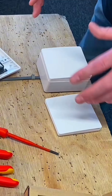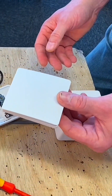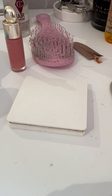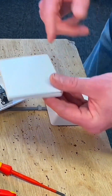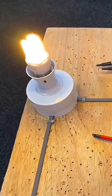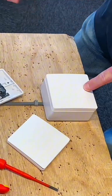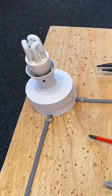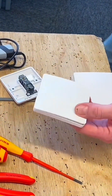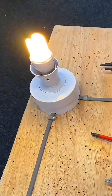I've introduced another very similar switch. You could stick or screw this to the wall — my daughter has left hers loose on her bedside table so she can move it around, which is also a nice touch. You could use tape on the back and stick it to the wall, or fix it into position, but we'll have it free-standing for now. At the moment it doesn't do anything — it's not operating the light, but the installed one is. So we've got to bring it into the pairing process, which is about a six-second hold. Push it and hold for about six seconds and then it should start to flash, at which point it will be in pairing mode.